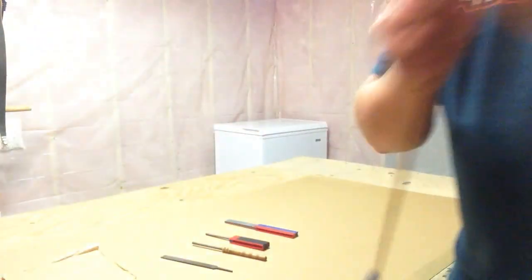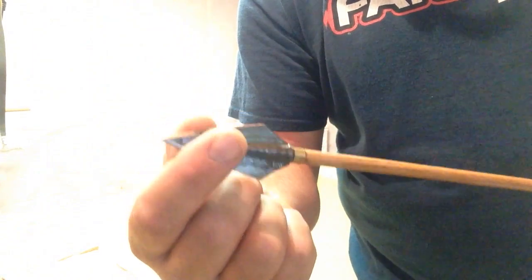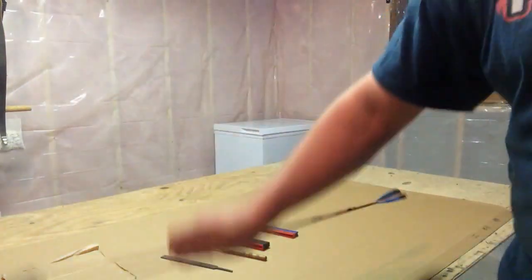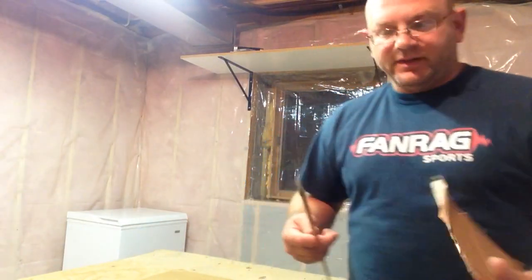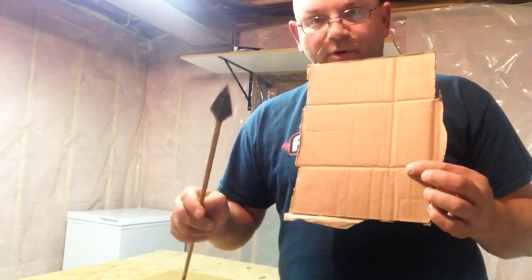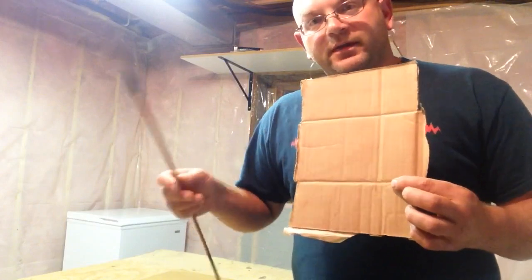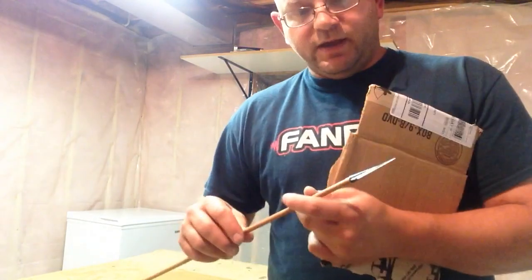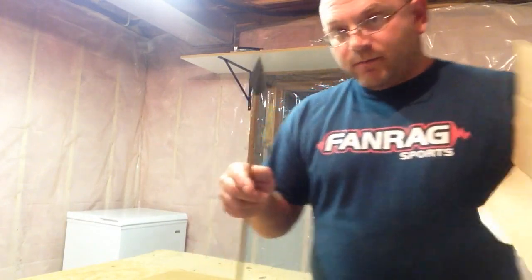The final step is stropping. Stropping is an old-timey blade term meaning moving the edge of the blade - whether a knife, broadhead, or whatever - back and forth, dragging it backwards over leather. Stropping can take many forms these days: we still have leather strops, some people do it on their blue jeans. The best thing I've found, and you can probably find this lying around, is just a piece of cardboard. You do need to have the burr off or almost completely off first. Some people take it to a polishing wheel with jeweler's rouge - like a polishing compound - and it'll put a super fine scalpel edge on there, but if this is all you've got...